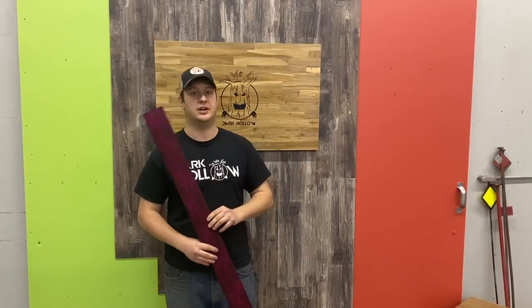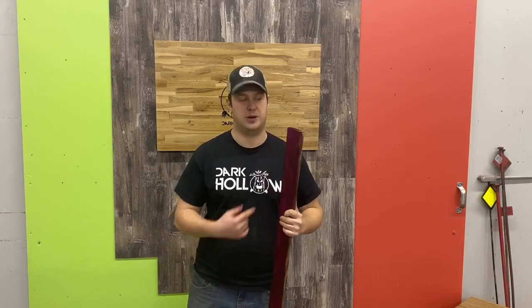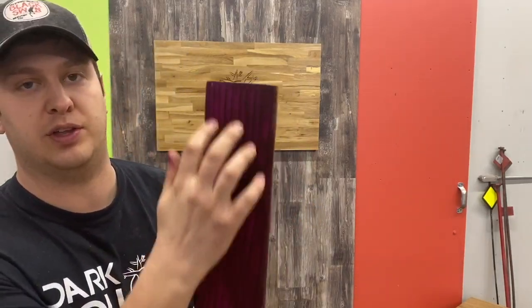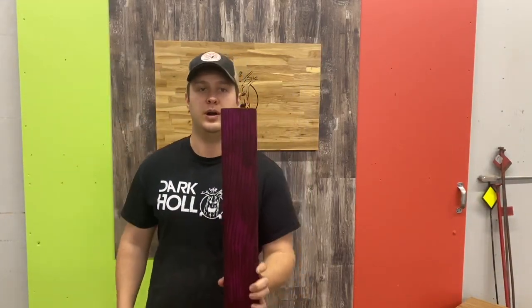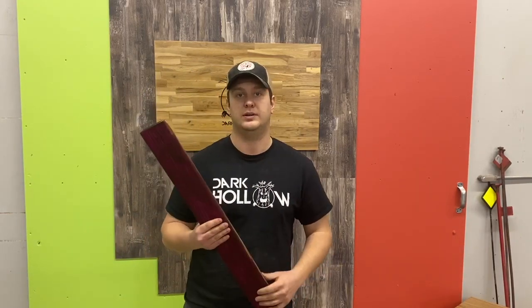The handle is dyed, as you can see here. And then we just have to take it to the miter saw and cut to length. We're gonna cut it to 4-inch chunks because we're gonna run it vertically to keep that Thanos chin molding look. It's hard to see, but there's the grain running vertically, that really nice grain. And the purple dye for the shou sugi ban makes it really nice. So yeah, we're just gonna cut this vertically and then we're gonna dye the ends after we have cut it.